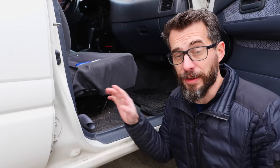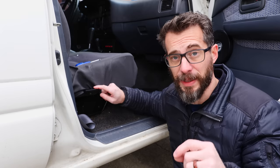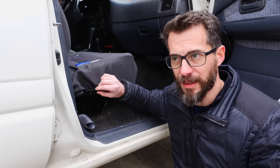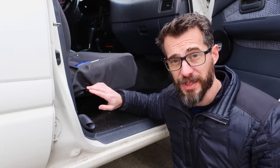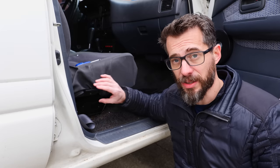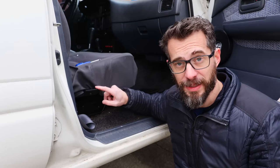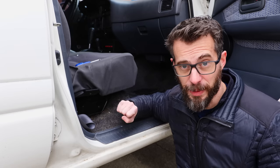That thing worked perfectly. The only thing I might change is to go back and reprint this at 100% infill so it's really a solid piece of plastic. Right now it has a little bit of squish in it that might end up causing a problem if you pull on it a lot. If it's printed at 100% it will be a solid piece and will be just fine. And even past that, if you really wanted to, you could make a mold of this piece and cast it in something like urethane. Okay, so this thing is done.